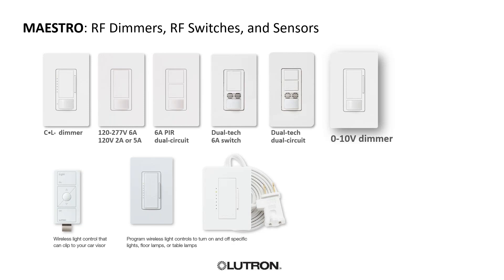If you're not quite there yet with a system, you can do standalone Maestro RF products. What you see in the bottom left is a Pico remote that speaks radio frequency — also known as Lutron's Clear Connect, 434 megahertz. It transfers very little information, only that you want however many lights it's paired to to turn on. To your right you have your lamp dimmer and in-wall Maestro dimmer. You know they are wireless because they have a squiggly line in the bottom left. When you want to pair a Pico to one of these products, you don't need internet — you press and hold the button of the in-wall or lamp dimmer until the LED blinks, then press and hold the bottom off button of the Pico until both LEDs blink.